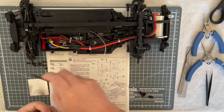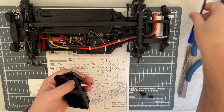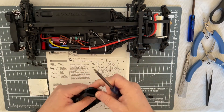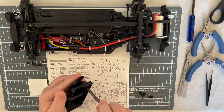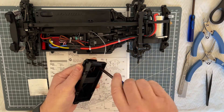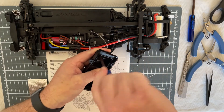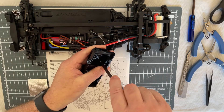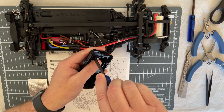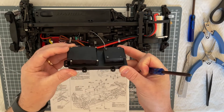You're literally going to pop your screw into place using a slightly bigger screwdriver - these are slightly bigger screws. Just popping that in the hole and finding the hole in the cover. Don't go too mad here - just nip it up until it stops, using just the fingertips. The cover just has to stop moving. So now that's the cover part done.